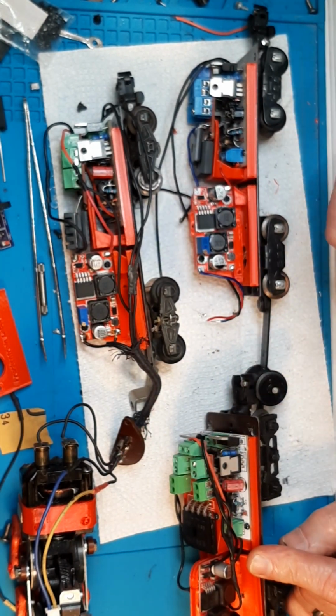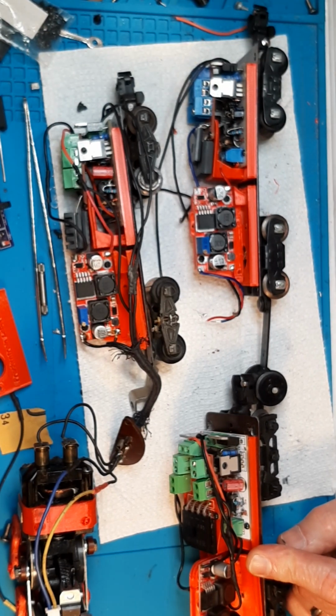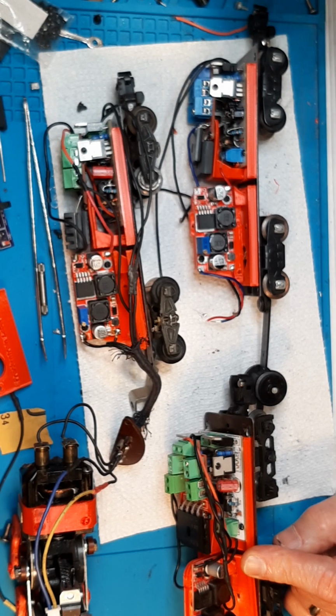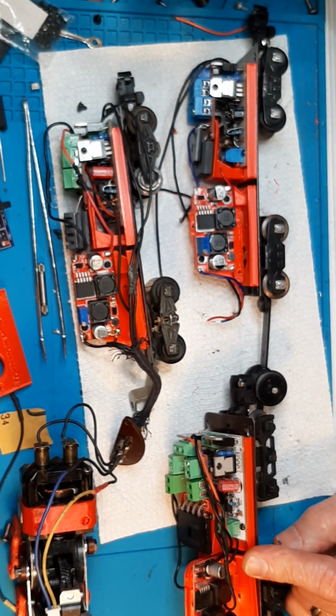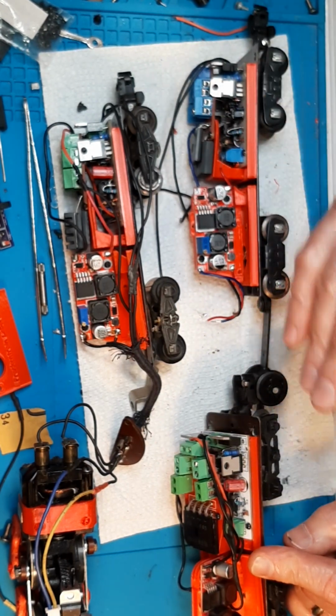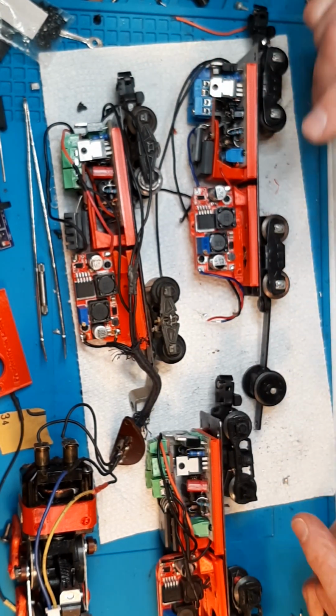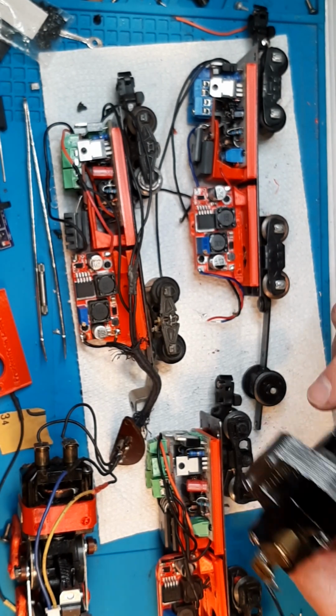I'm printing one right now, but it's only half done. I've got it on 125 millimeters per second, which is as fast as I dare print. And I've added some supports. I've cut down the infill to the bare bone because this is not a strength part, okay? We don't need 100% infill like on my gear thing.